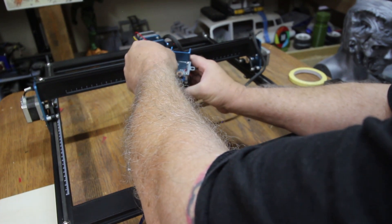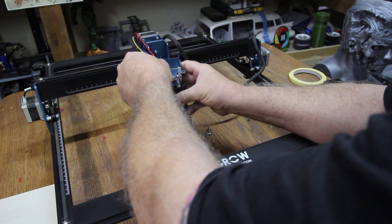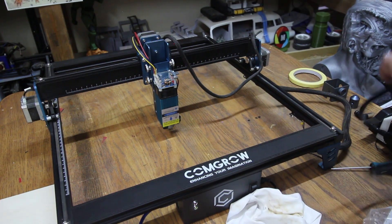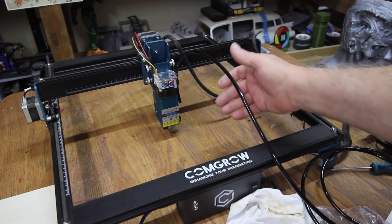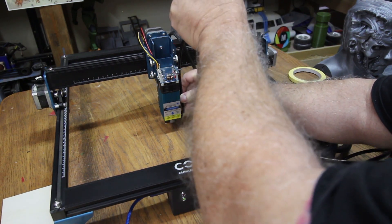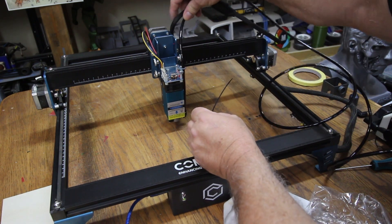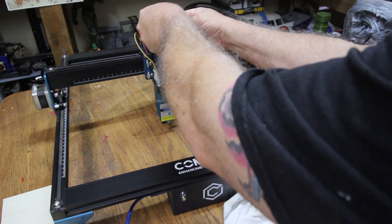Remember to plug your two wires back in. Pay attention to which one went where — if you're not sure, take a picture before you start so you know which way they plugged in. Then take your four thumb screws and put them in on each side. Now let's run the tubing down through that hole on the top and press it into the fitting below — route it so you can get it pressed in. Now it's time for some zip ties; put three or four on it to hold it out of the way and attach it to your other wires so they move around together.